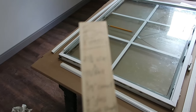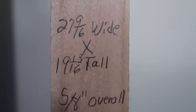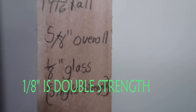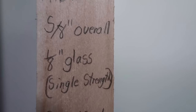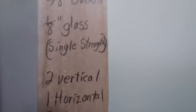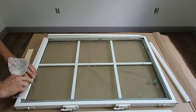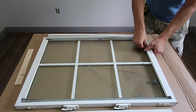I could order through the window company, but in my experience it's easier to order through a local glass company. The dimensions I need are: 27 and 9/16 wide, 19 and 13/16 tall, 5/8-inch overall double pane with 1/8-inch each glass pane — which I've found is pretty typical for standard residential windows. It has two vertical grids and one horizontal grid, 5/8-inch wide, white, and no Low-E, just clear glass. My local glass company can usually have it ready in about a week. At that point I'll snap in two of the trim pieces and put the window back in while I wait.